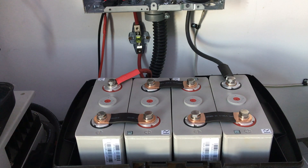Hi, this is Myles from Light Harvest Solar. Today I wanted to show our test on our lithium batteries. These are CALB 180 amp hour cells, 3.2 volts each, so you have to have four of them to essentially make the same voltage as a 12 volt battery, but of course it has different charging parameters.